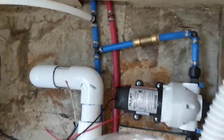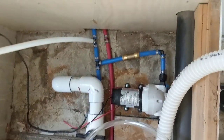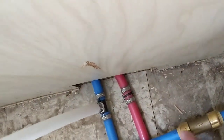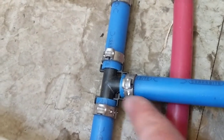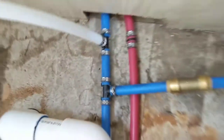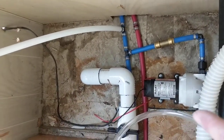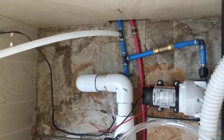So that's the basics of a water system for a trailer. I highly recommend PEX — it's just a lot easier to work with and a lot cheaper than copper. I use these crimp rings and they work really well. I know some people have had them leak, but I never have, and I do a lot of plumbing work — not just for campers. The crimp tool is probably about $60 and it's definitely worth having. The plastic fittings work just fine.